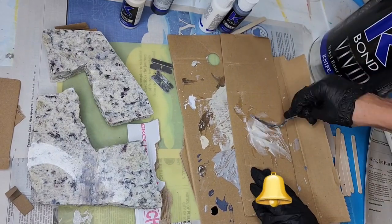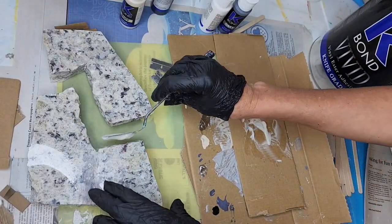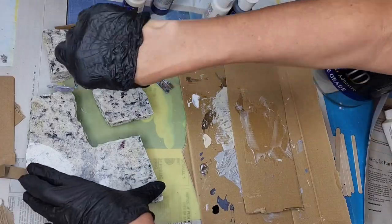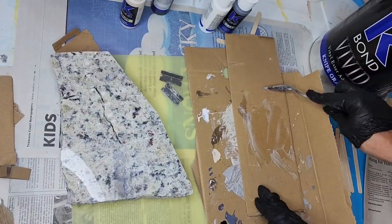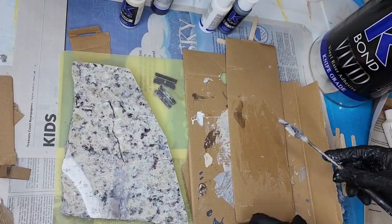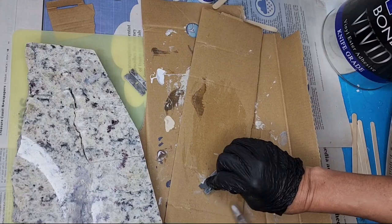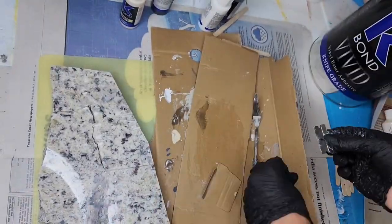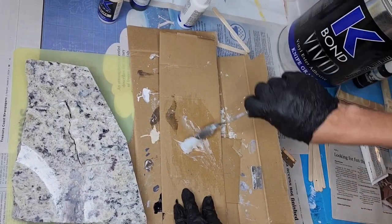At this point I'm going for my last round, hoping everything connects nicely. If you don't remove the excess product from your granite while it's still soft — before it hardens — you're never going to be able to remove it. If you're doing a section at a time, make sure you remove whatever is on top of the granite before it gets completely hard. I found it's better to pin the spatula down and pull it back rather than scraping forward with the razor.